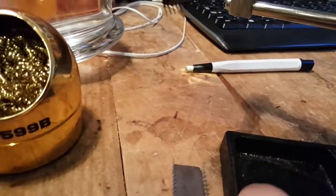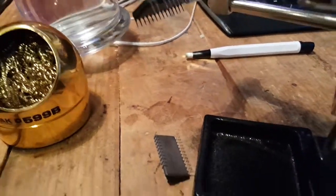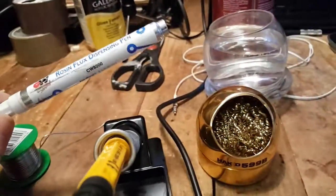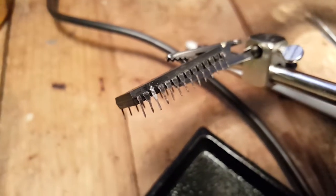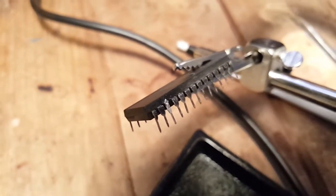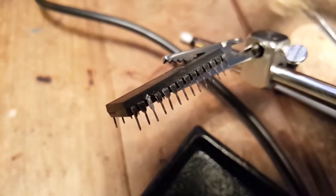I'm not sure I can show you exactly the process but I'll try. I'll put some solder here and some solder on the leg, I'll try and film that, and then I'll put them together. It's quite easy once everything is prepared. What you need to do is just tin that area and the leg, and I'll use some flux as well just to clean everything. And there you go - the leg is back on. It's not the cleanest soldering job but there wasn't a lot of room, so I think it's quite acceptable.